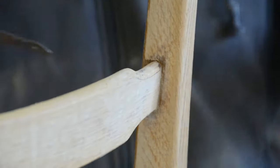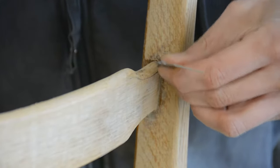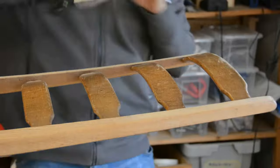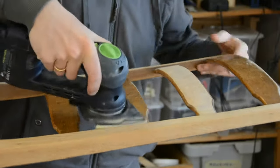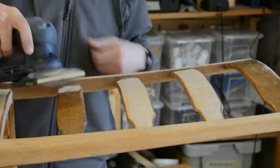The good news is that the coating is very thin and can be removed without any chemical strippers. It's a lot of sanding with a random orbit sander and hand sanding, first with 80, then with 120, then with 180, and finally 240 grit.